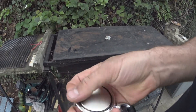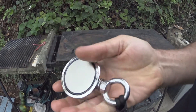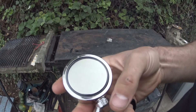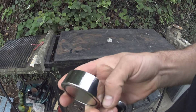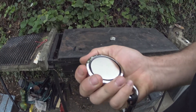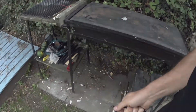So I might go into work and make a little holder and either clamp it round a bit like a jubilee clip sort of thing with a big eye of metal on it, or bore it about 0.5 undersize and then heat shrink over the top - just heat it up and drop it over, that'll be more than enough to hold it in there. Probably have to drop some Loctite on the threads as well so they don't go walkies. We'll give it a crack - probably Friday, see you there.